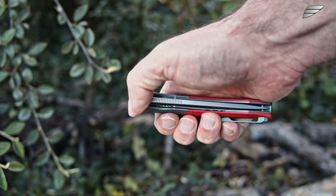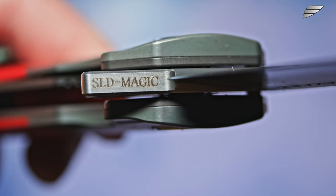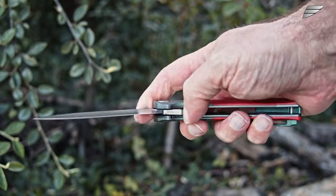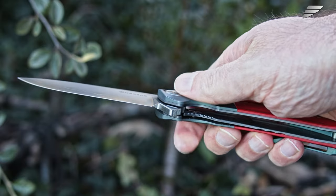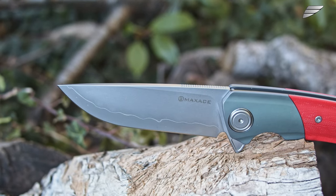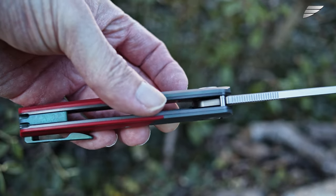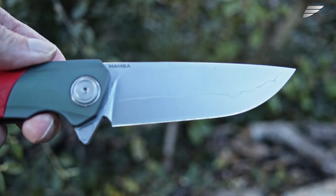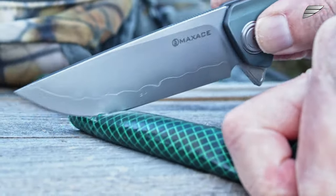The lower chromium content of SLD Magic will make it slightly less resistant to corrosion, but it should be slightly more resistant to impact. D2 is generally not susceptible to corrosion if the blade is dried after use. You'll have to be a little more scrupulous with the SLD Magic. The SLD Magic's greater toughness, and hence resistance to chipping, is a positive point.